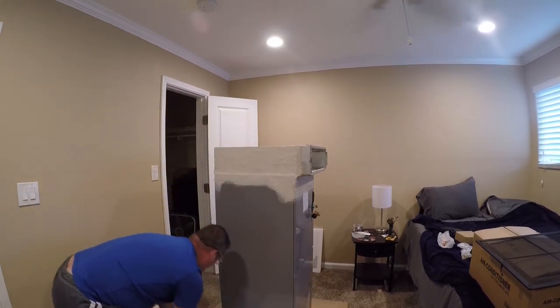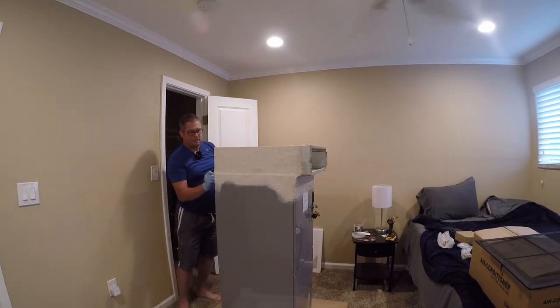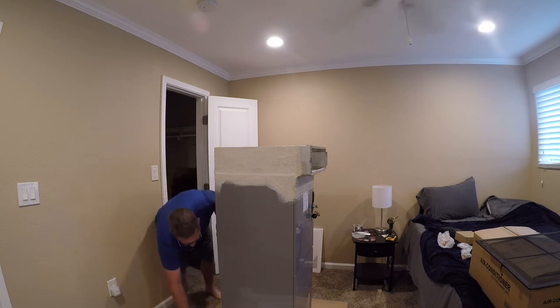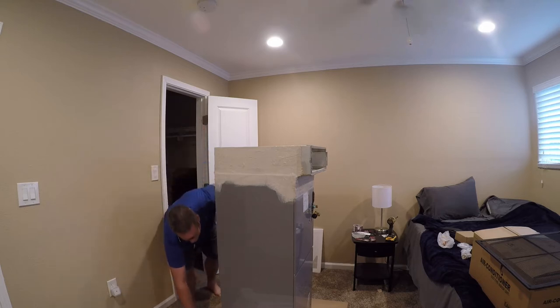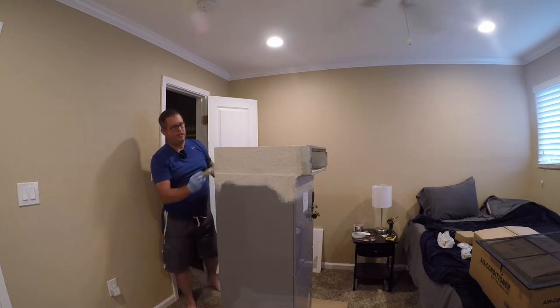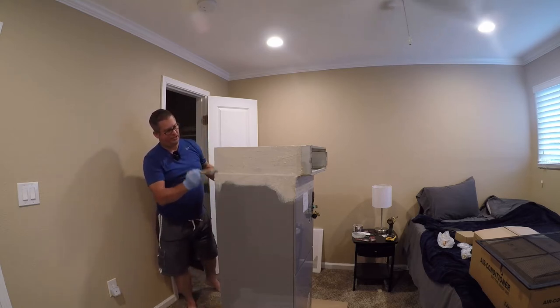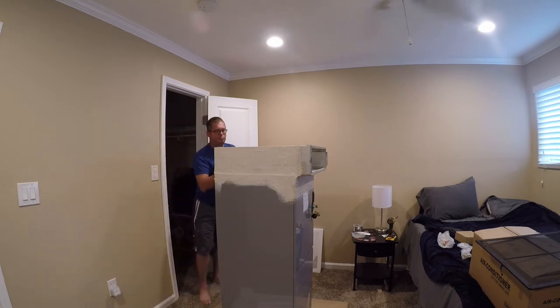Protect the floor you're working on. I'm using cardboard in addition to some scrap styrofoam. You just want to get a nice thick coat - this has a 16-hour cure time, so time is on your side if you're not in a hurry. In my opinion, this is much easier to do when it is not in an attic.